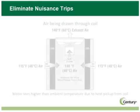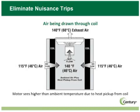This makes the Heatmaster ideal for high-ambient rooftop applications where temperatures in the summer can soar. In the old days, the motor was mounted on the cool side of the coil. But in today's modern high-efficiency designs, the motor is mounted on the hot side of the coil. So, if it's a hot summer day and the surrounding air is over 100 degrees, that hot air is drawn by the fan over the coils. As the air moves over the coils, it gains heat — sometimes as much as 30 degrees. This heated air then passes over the condenser fan motor, and in this situation the motor can easily reach temperatures of 140 degrees. The old Class A and B motors just won't cut it.